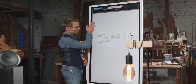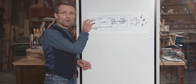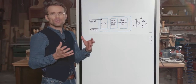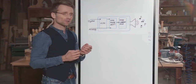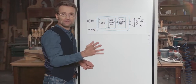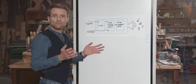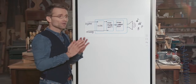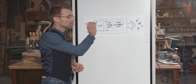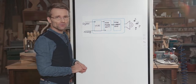If you remember, we're at the first stage in our amplification process — the conversion stage. If you introduce a noisy signal into the rest of the amplification, that noisy signal would be magnified by the next stage. What we've done with the VLSC is eliminate all that pulse noise, so there's no pulse noise at all anymore and we've got a clean waveform going into the next phase: the non-phase shift amplification phase.